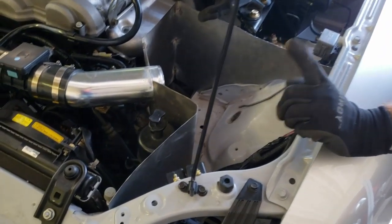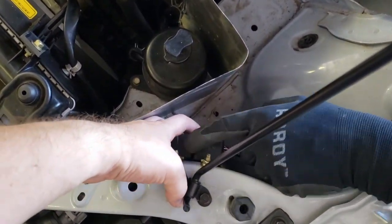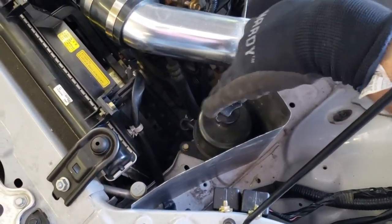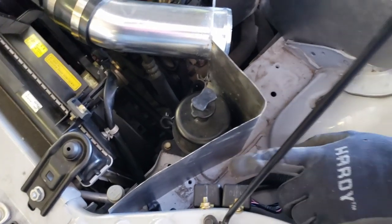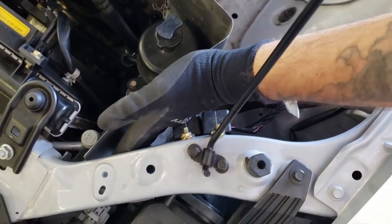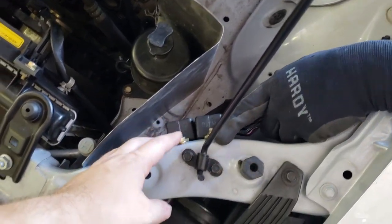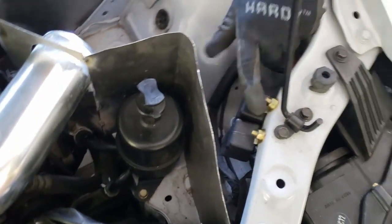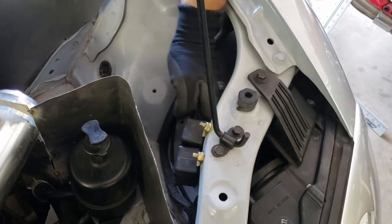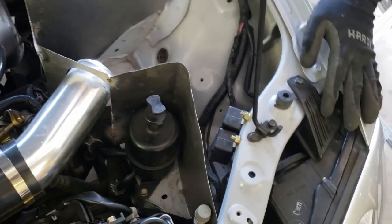We didn't show you guys the other day, but there's these two relays right here, and they were mounted on the outside of this airbox shield thing from the factory that was right here. And so they need to stay in a path of air. So down here is where the air came into the factory box. So we drilled with a step bit right here into this lip and just mounted them right here. So they got air going all the way around them, as you can see my fingers right there. So that keeps them nice and cool.